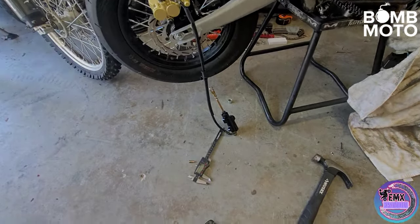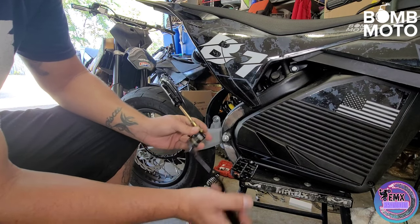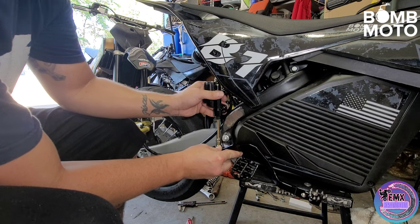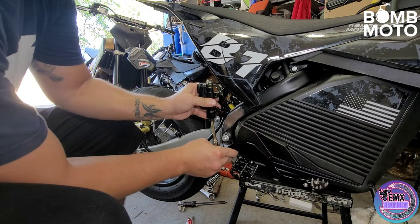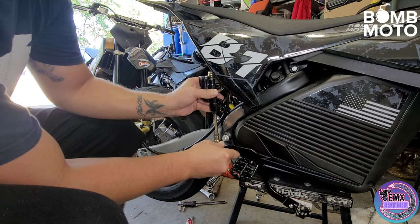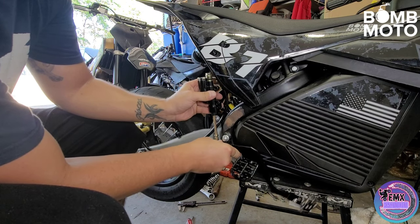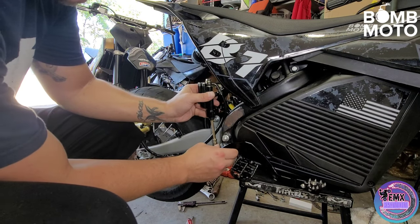So what I'm going to go ahead and do is weld this through — somewhere around here I'll kind of eyeball it and figure out where I want the lever to be in association with the bottom of the master cylinder's stem that goes up and down. I want to make sure I have enough up and down play so I'm not bottoming out on the top, and I can still reach wherever I end up putting the master cylinder. Let me do some more prep, figure out where I want to weld this, and probably make a template that I can cut out of steel. I've got some scraps back there. So that's about the position I like — I'll sit on it, make sure I like it, and then I'll make my template and get this bracket made.